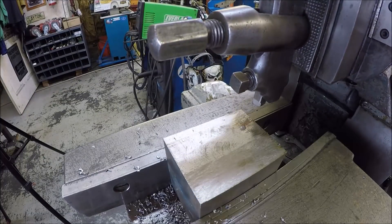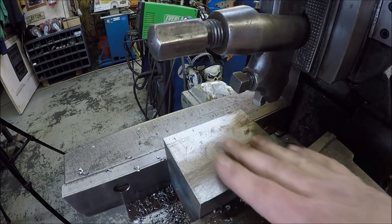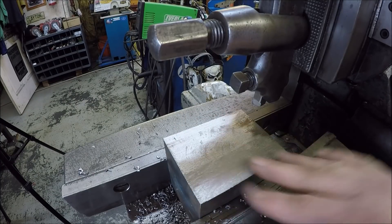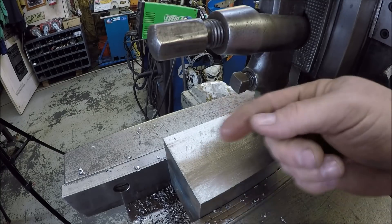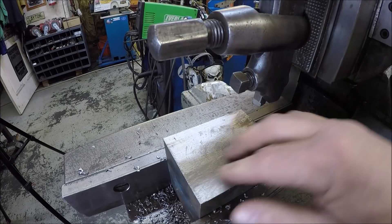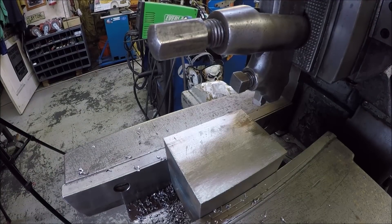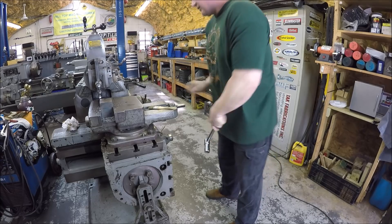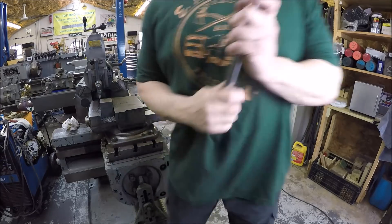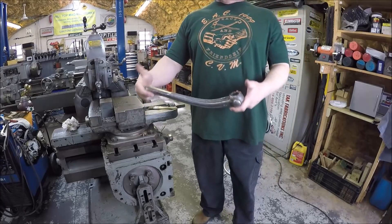Alright, we're done. Sweet. The finish is rough, obviously. I'll work on the grind of the bit, plus it's 1018. The tool is dragging a little bit on the way back because I have it straight up and don't have the clapper box turned. But anyways, that is exciting — our first chips! Let's get her up. I still got to fix the original wrench — it's still shaped like a banana, still on the to-do list.